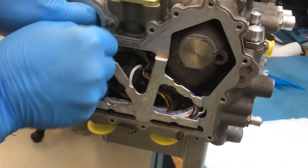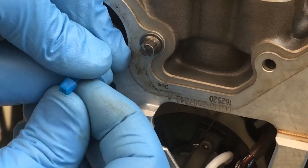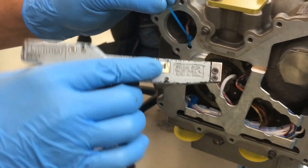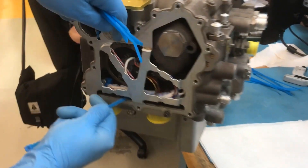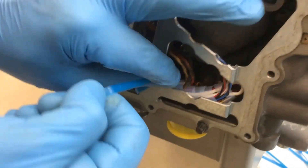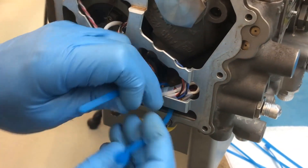The wire retention bracket has notches that are used to locate the majority of the cable ties. The cable tie that holds the wires from the AFSO switch uses a hole in the wire retention bracket. Two sizes of cable ties are used to secure the wires to the wire retention bracket. One cable tie holding the Teflon wrapped wire bundle does not have a corresponding notch. Ensure that the cable tie head does not protrude past the wire retention bracket before use of the Panduit installation tool, so that the cable tie does not interfere with the installation of the electrical cover.